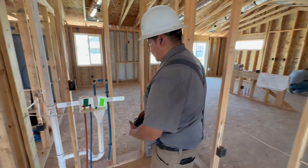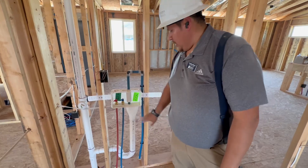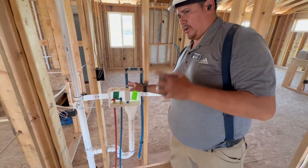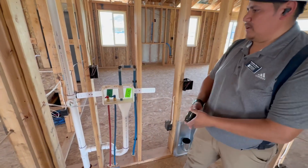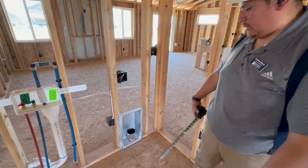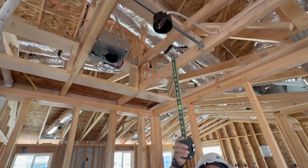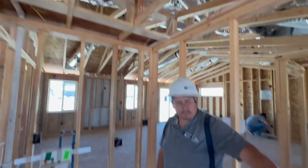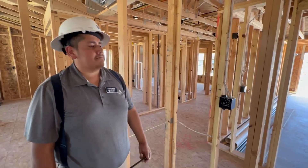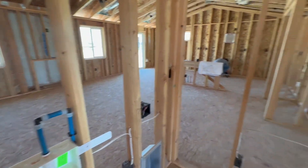We're inside your laundry room. You've got your washer box — you've got your cold, your hot, your cold, and your drain. This right here is your drain for your water softener — so it will drain right there. You've got an outlet, another outlet, and this one's your dryer vent. You've got an exhaust fan, a light fixture, and your switch right here — one will be for your light and one will be for your exhaust fan. One other cool thing about this area is it will actually be fully insulated for sound, so you don't hear your washer and dryer when you're watching TV.